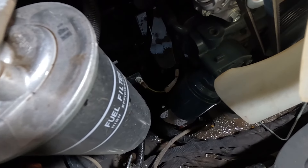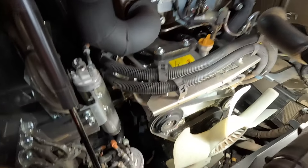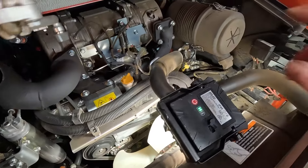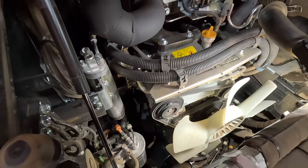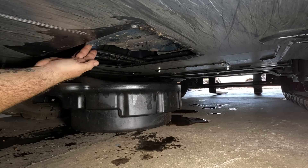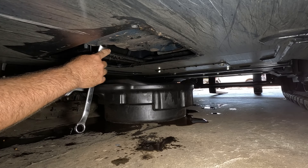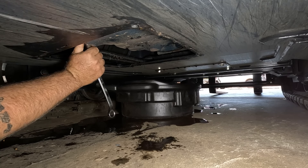So the one down there is our oil filter — the one that's painted blue. And you can see the fuel filter right there, and that's like your water separator. I believe there's a little filter in there too, maybe like a gauze one or something. Yeah, today like I said it's only the 50 hour service — I'm actually at 41 hours — so I'm just dropping the oil, doing the filter, new oil. You do the air cleaner but I do that after every job anyway, that's just what you should do. Let's drop that oil. There's the plug there — 22mm, I believe.